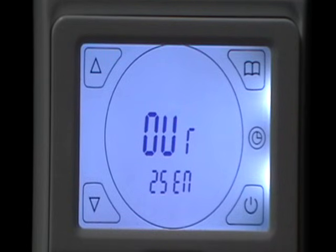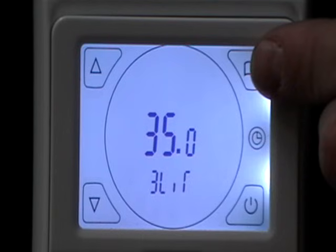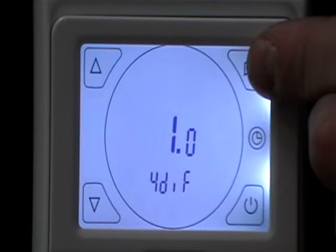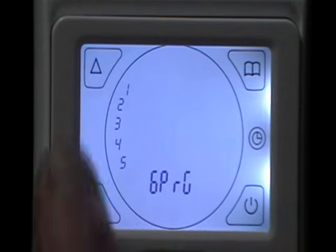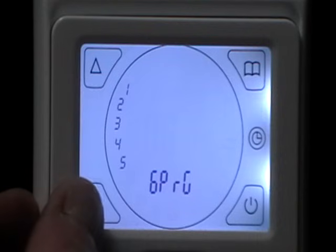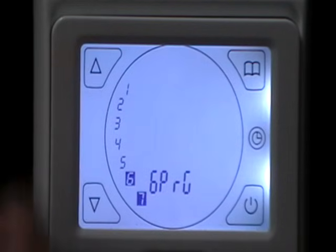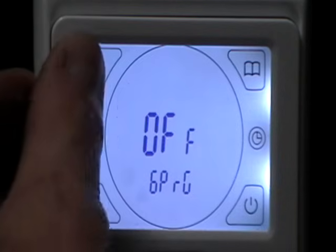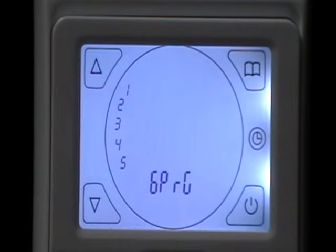The only other advanced setting that may be useful is when you are setting the times differently over the weekend. To go to this mode we need to go to number 6. Hit the menu button once — each time you hit it, it takes you to the next advanced setting. We are now in number 6, PRG programming. '1 to 5' means it's set for a 5-day period and then a 2-day period separately. Using the arrows we can go to '6 and 1' for a different Sunday, or '7 days' for the same all week. Turning that off means the control runs on manual setting, regulated with your up and down arrows.